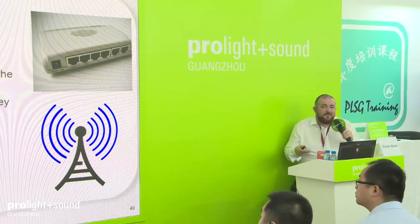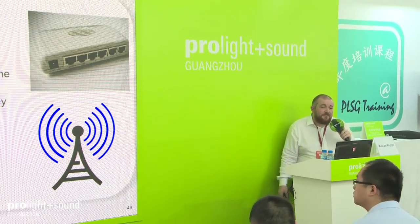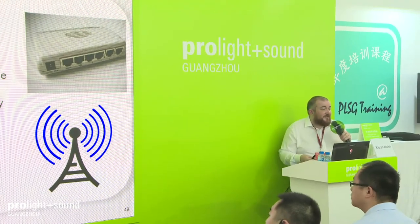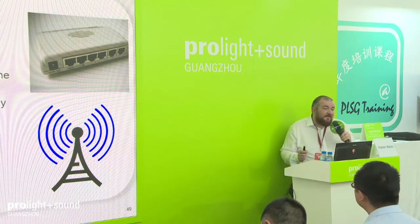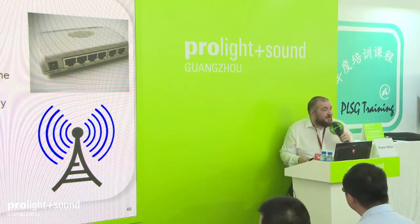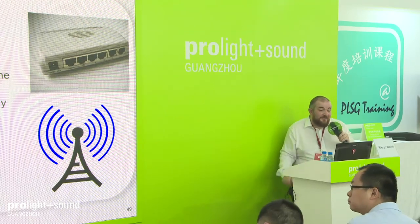A hub is potentially the most dumb piece of electronics going. It just repeats the messages coming in. All messages in a hub are effectively broadcast messages. It has no way of distinguishing any kind of addressing. Effectively, using this method, we remove the idea of having a sorting office from our postal system. We just throw paper envelopes everywhere and hope they get to their destination.